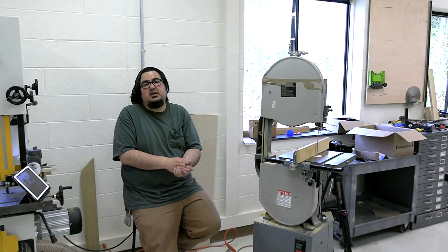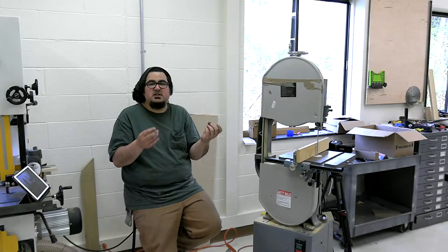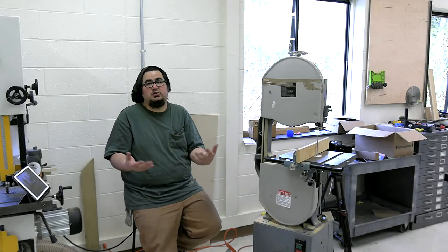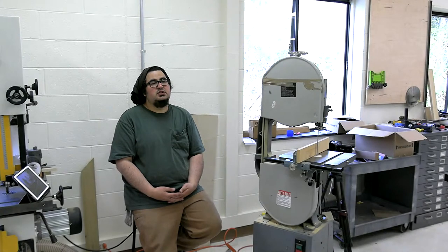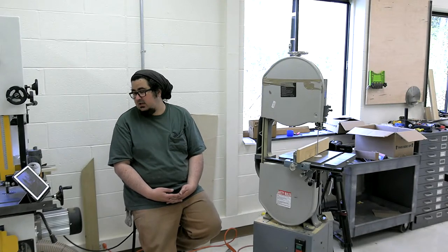So, and this is something I learned from Tim Rousseau, another guy up in Maine, that those smaller blades, a half inch blade, just does not have enough mass to it to disperse that heat or to handle the heat of a resaw. And so I have a riser block on my saw, and honestly, the only reason why I do is so that I can resaw 7 inches or 7.5 inches. I'm not going to pretend I can resaw 12 inches for 1 minute.